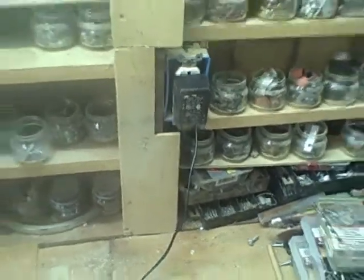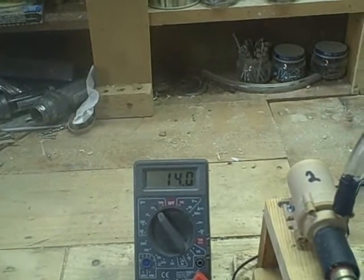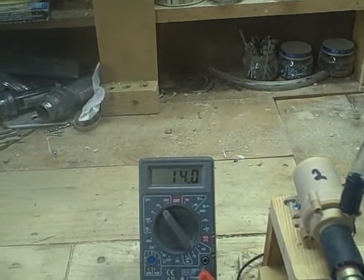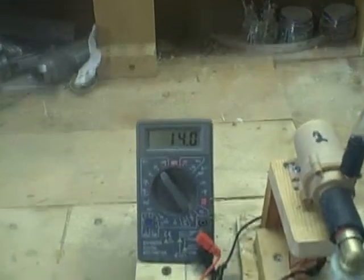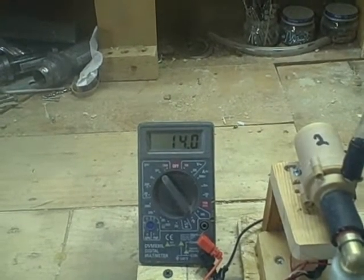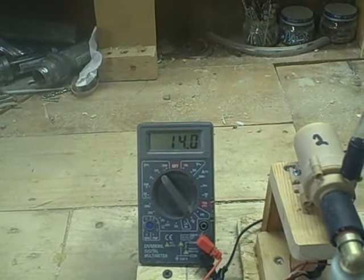Now, right now, our power supply, instead of a photovoltaic panel, we have this little wall wart power supply. It's a 3-watt power supply. So don't expect too much from it. These are 6-watt pumps. So it'll be amazing if they can even turn the pumps at such a low power output. So you know that power is equal to voltage times current, but we're just going to be monitoring the voltage right now. And this will give us some idea of the amount of current that's available.